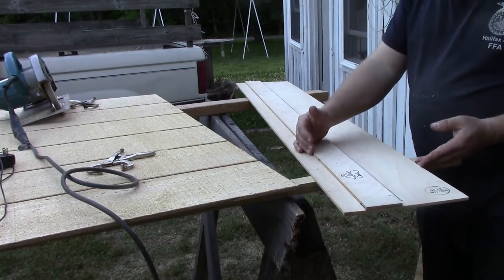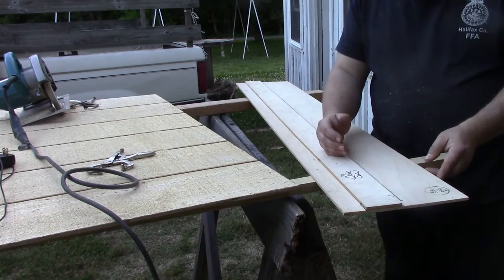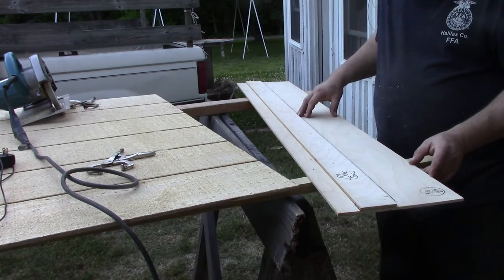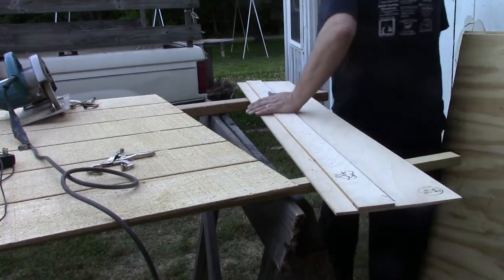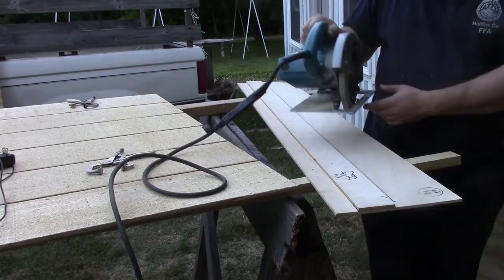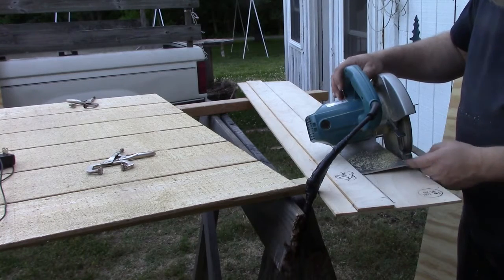And when you build this, you want to build it wide enough so that the very first time you use it, you're not cutting on your panel. You're going to cut this edge just by itself. You just set your saw on here and run it down, and you cut this edge. That gives you your edge, and that's the set distance between the edge of your saw's foot, of its base, and its blade.